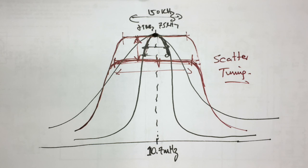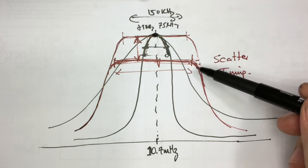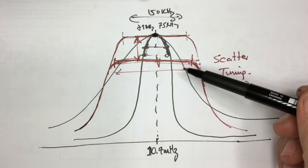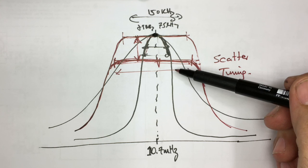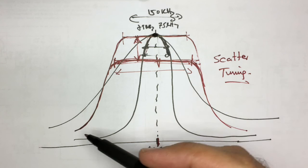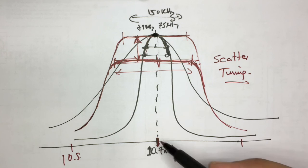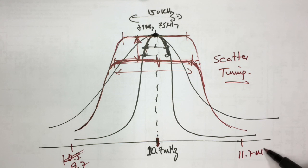And I tried a lot of things on this because I had no FM. Fortunately, it was only tuning the IF transformers and changing that electrolytic capacitor. So what I'm going to show you here, having done it already, because I needed to get the FM back, so this is sort of cheating, but what I'm going to show you here is I'm going to set a sweep generator up. The center frequency will be 10.7. I'm going to start it at 9.7 and end it at 11.7 megahertz. So we've got 1 megahertz either way, with the 10.7 slap bang in the middle.